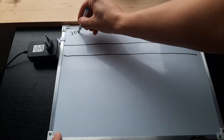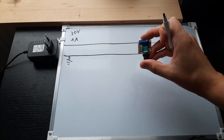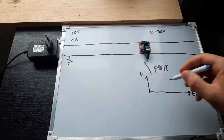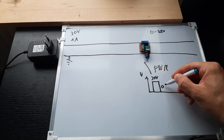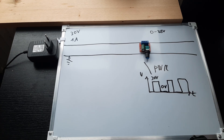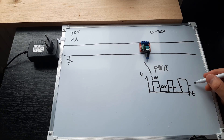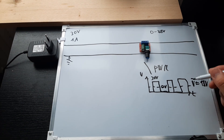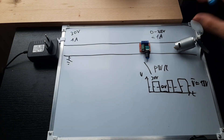I have a power supply with a maximum current of 1 amp, and to lower the voltage I'm using a speed controller. The speed controller works by creating a PWM signal which turns on and off the power supply, and the output voltage is defined by the fraction of the time being on and the whole period. So if the power input is half time on and half time off, the output voltage is gonna be one half of the input voltage. The problem with this is that it doesn't increase the current, and I have a suspicion that the motor draws more than one amp.